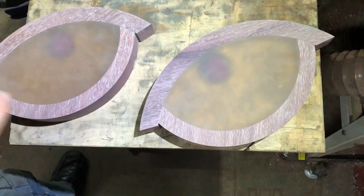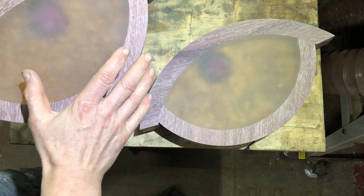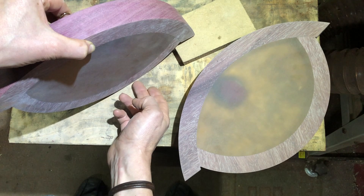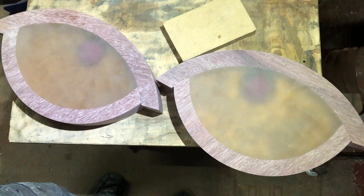I've sanded it to 240 grit - that way I know I've got nice level flat surfaces. My next job is to fit some sort of hanging bracket - one of these on the back. I've compared these to the image of the lion eyes I showed you earlier. The angle I need lines up with this bit of MDF for that bottom corner - if I lift that, it comes off there and there at exactly the same time. And that is the desired angle I wanted. The difficult thing will be getting the other one exactly the same. Just need to mark the back of this, then attach and hang it off a spare bit of MDF board I've got lying around, see how much they line up or not. Well, now it's looking pretty good - almost perfectly lined up. Obviously they're not going to stay on the MDF, it's just there to try it on. They'll actually hang on a wall.